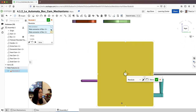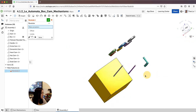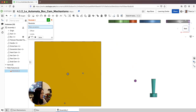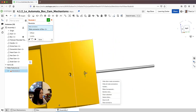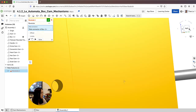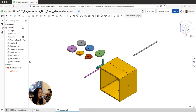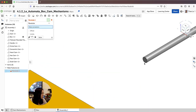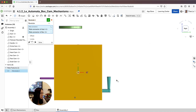Let me double check that — I clicked the box twice. So go back to the axle. I put it the wrong way. The edge of this right here — that's the green part — and then I'm going to mate it to the hole right here. Let me try that again: revolute mate connector, grab this end, and then the side of the box. Okay, that's better.